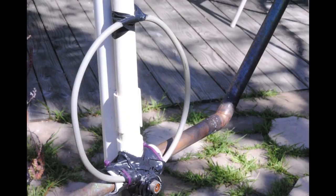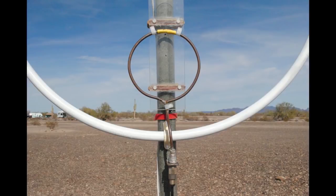Absolutely. And Jim and I did some playing around because we had read on the internet that you could reduce SWR slightly by mooshing around the bottom of the feeder loop. And yeah, we saw a change in the SWR, and that change did make a slight difference, but it really didn't in the performance.